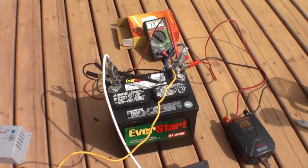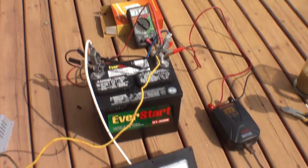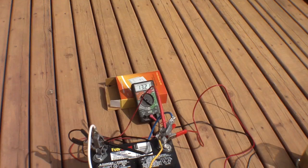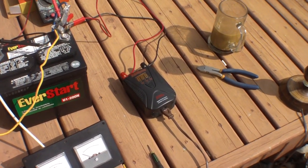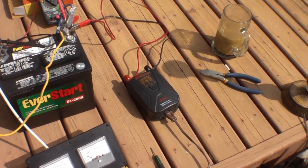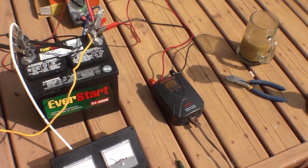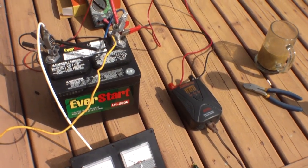You could think of this as your garden shed setup, your pond setup, your canopy setup, sliding truck camper setup — just when you want some extra power or remote power where you're not normally going to take it. With that 200-watt modified sine wave inverter for 20 bucks, you're not going to do a whole lot. When it comes to induction motors, the best way to go is pure sine. I don't offer pure sine at this point but I recommend Samlex — Maine Electronics in Vancouver is a really good way to go.